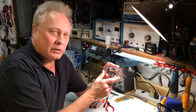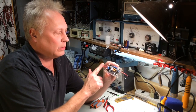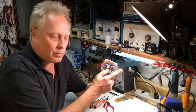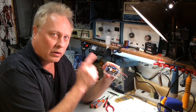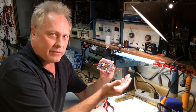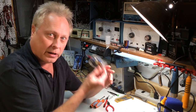It's an adjustable voltage DC-to-DC converter regulator. It'll take a voltage input on this side and convert it to a lower voltage on the output. Say if I want to use my 13.8 volt power supply on the bench here and input that and I need 5 volts or 9 volts for a little project I'm working on — well, this will fit the bill for a good price.